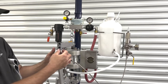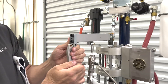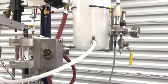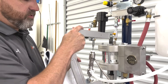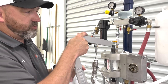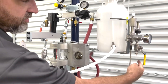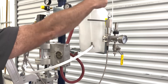We're going to remove the quick pin from the cast. We're going to leave our valve open and prime this manually. We want to pump it slow because if we pump it too fast, it cavitates. So slow like this right here — this is as fast as you want to go. We're going to watch material come down this line into the pump, pressurize up here, and dump out the valve and go back into the jug.